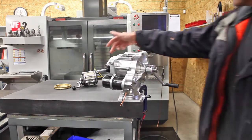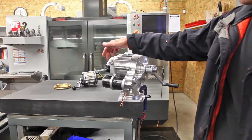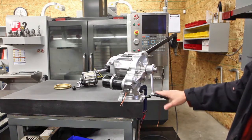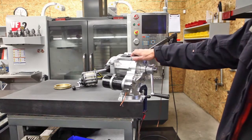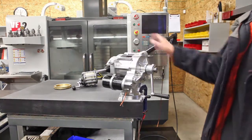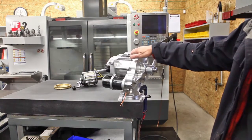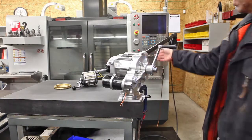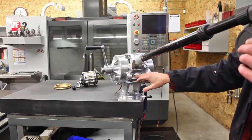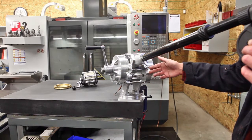So we have our shifter, which will shift in manual. Low range is a 1-to-1 ratio. One turn of the handle, one turn of the spool. Or you shift into the high range, manual. One turn of the handle, 2 revolutions of the drum, all while spinning the spooling gear. The spooling gear corresponds to the same ratio as the gear train is moving.